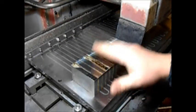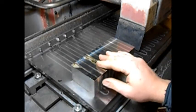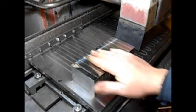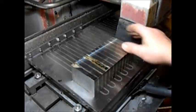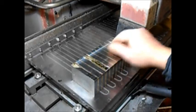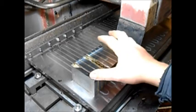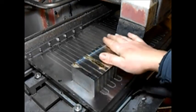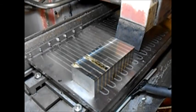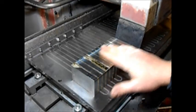Now we're just waiting for our long drill bit. What I'll do is drill these with a center drill first, then a jobber length drill, then a standard long drill bit — all in 6 millimeter. I've bought some 200mm long drill bits out of China off eBay, so hopefully they'll be good enough to drill the last bit of hole I can't do with a standard long drill bit. I have a 6mm long drill bit as well as a quarter inch one. Once it's 6mm all the way through, I'll use a nice quarter inch drill bit to come from either end to clean them up, Loctite some quarter inch pins in, sink the ends, and peen them over.